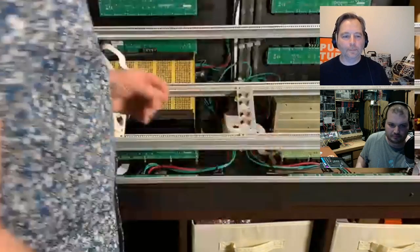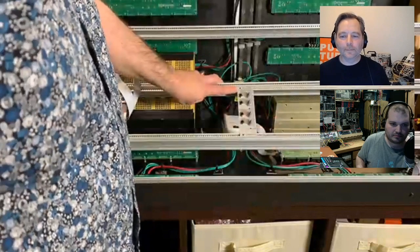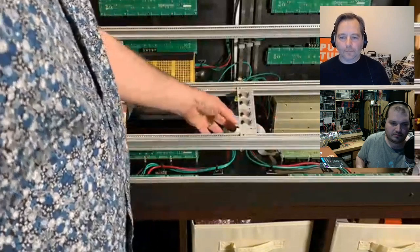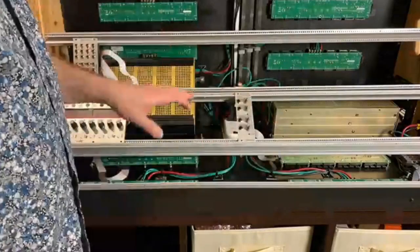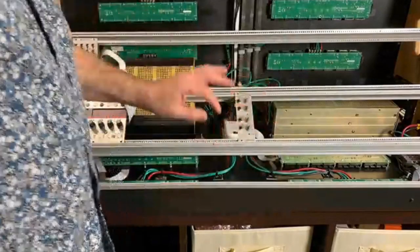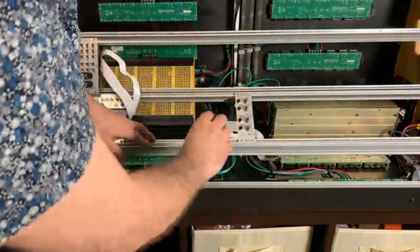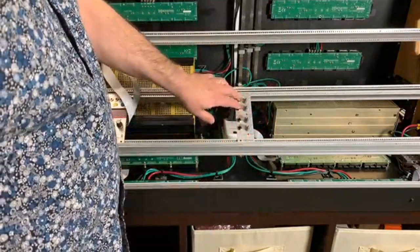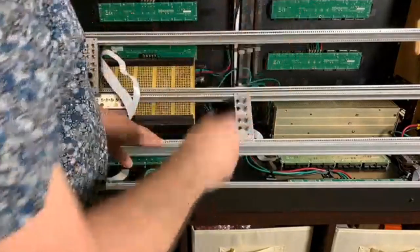Part of my arsenal for triggers and notes has now become always having a trigger delay module. I have the Erica Pico T to G trigger to gate in my gigging case, and here I just happen to have the Doepfer A162 T-Del, the dual trigger delay. And trigger delays by themselves are kind of cool. You can do some Steve Reich phasing stuff where you put stuff out of time and bring it back in time. You can use it to add a hold stage in front of an envelope, so you get a delay in when an envelope maybe opens a filter.